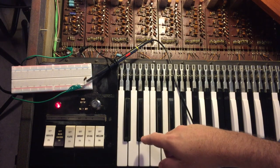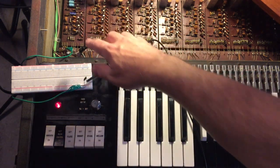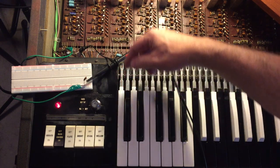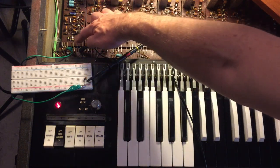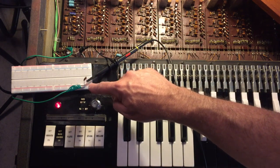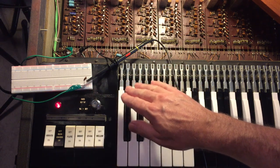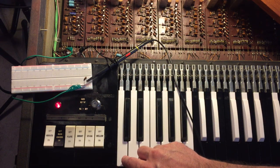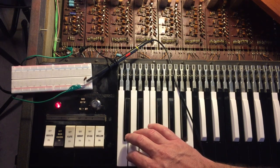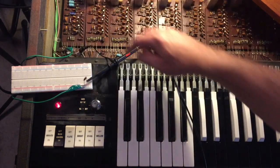I'm trying to solve the problem I mentioned in the previous section on the bass low C divider vibrato board. I'm going to hook an oscilloscope probe to the output — this side to ground and this side to the output for the low C to keyboard. There's a capacitor here because I noticed a DC offset when I first hooked it up, and that takes it away and lets the signal pass through so I can read it on the scope. Spoiler alert: it's actually working now. I think just in fiddling with it I must have completed a circuit — maybe one of the connections was bad.